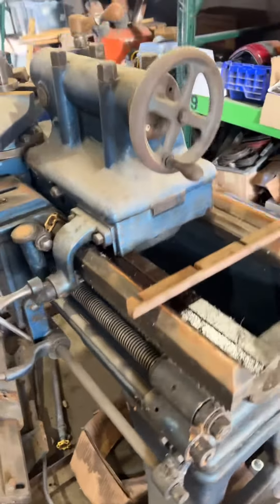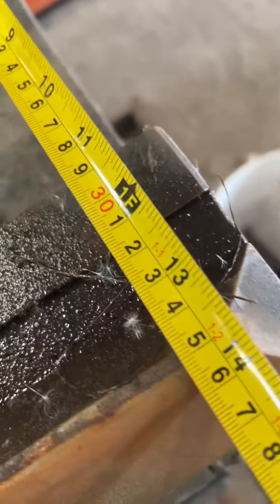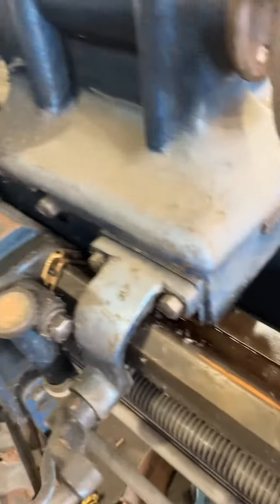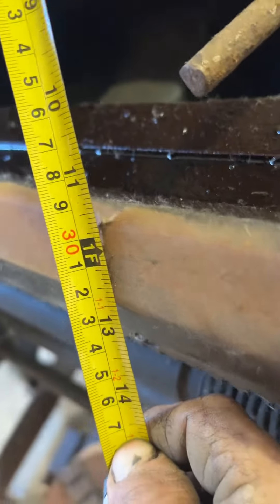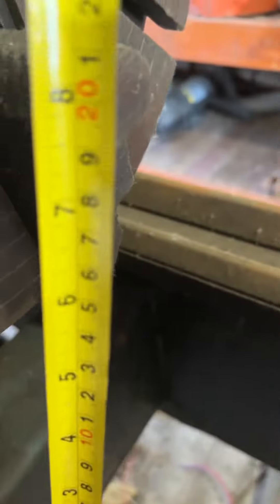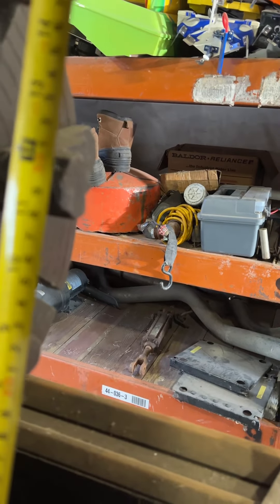Let's see what I can do here. Got it like that. Center of the chuck, roughly down that way, is about a 12-inch swing. Let's see what I got down this way. Up there looks like an 11-inch swing. So, 10 to 11 inch — safely 10.